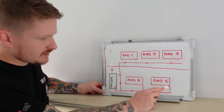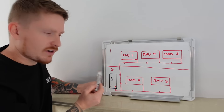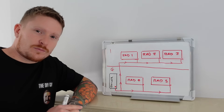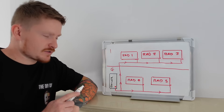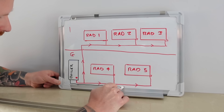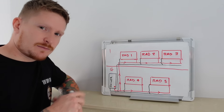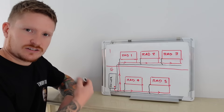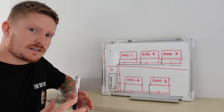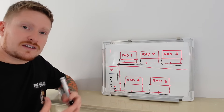The flow pipe comes up into the bottom of the radiator and into the bottom of a thermostatic radiator valve, so each radiator has flow coming in with hot water going to it. But the boiler is going to want its hot water back — this is a circuit. So we add return pipes running next to the hot water pipe, and each radiator will have a return back to that pipe via something called a lock shield valve, and then back into the return pipe and back to the boiler. The lock shield valve may be the reason your radiators are either not getting to the temperature you require, or not getting hot at all.